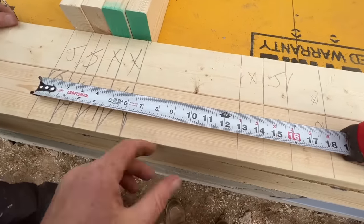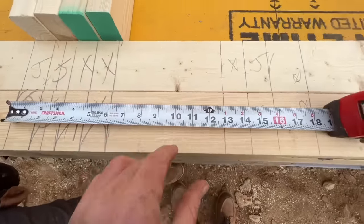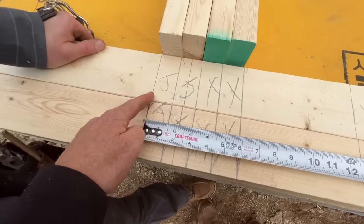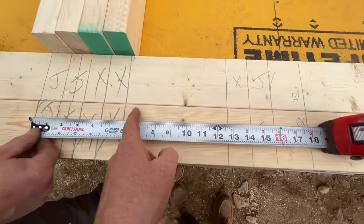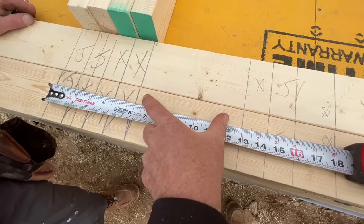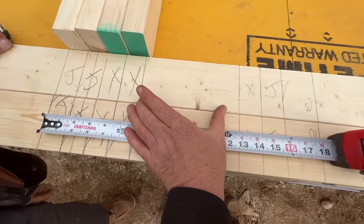We're laying out these plates and thinking about all kinds of stuff because it's not exactly detailed on the plan. We've got a door opening this way, and a window opening here, and I spaced this just on-site so that if they wanted to fit a four-gang light switch box in this section of wall, it's possible. Sometimes there's not enough space the way the house is designed, but in this case there is, so we're going to leave just enough for that.